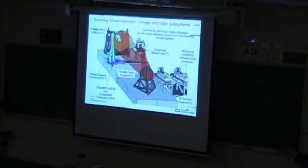The other thing that's really unique about this is that they wanted to do this during the early grind phases of the mirror. These mirrors are made of beryllium, and they're first cast and then machined. They wanted us to be able to measure these mirrors right at the machining stage. The problem is that the machining stage, while very good for machining, still has a roughness of 20 or 30 microns. It's a rough surface. Then they start with a coarse grind, which reduces it to sort of a 10 micron finish. Then what they'd like to do is take the information out of this with a map and deterministically polish the high places until they can reduce the overall mirror's structure.